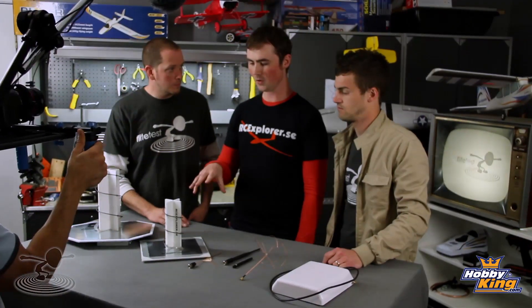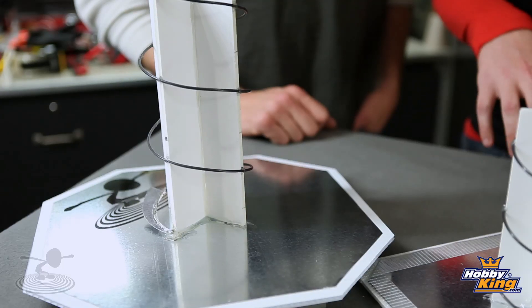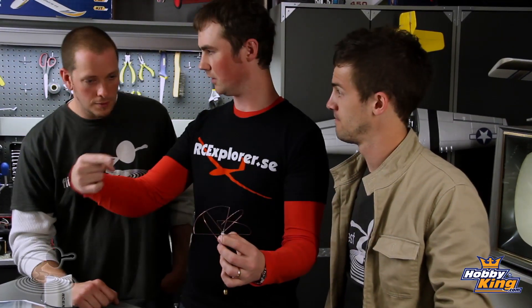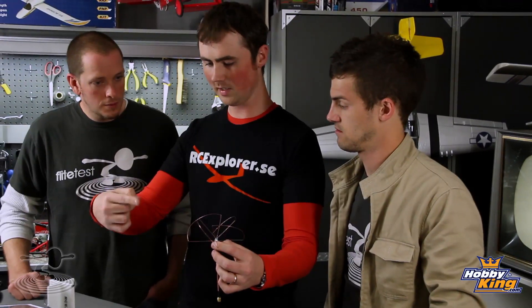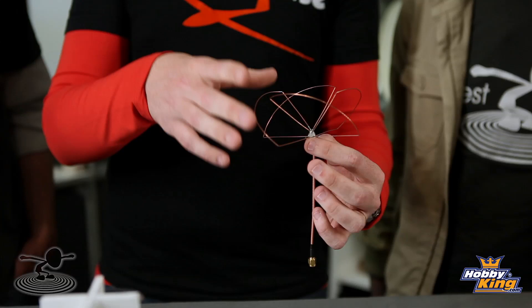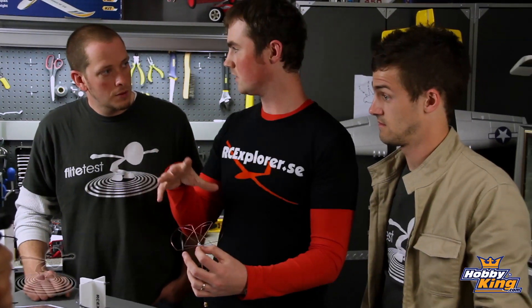So what's the answer to that problem? Circular polarized antennas — and that's what these are. They're much, much better for FPV flying. This is a circular polarized antenna which you put on your plane — it's a skew planar antenna. It puts out a corkscrew signal. There are two types: right-hand polarized and left-hand polarized. When a right-hand polarized signal hits an antenna made for left-hand polarized, it's going to have 26 decibels of loss. When the signal bounces off anything, it changes its polarization — it starts rotating in the other direction — and the antenna won't pick that up, getting 26 decibels loss. So the clear signal is going to have much stronger reception; it just takes the good stuff.